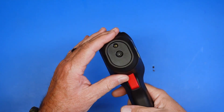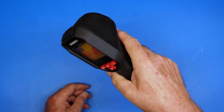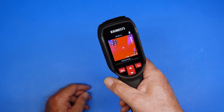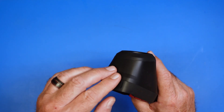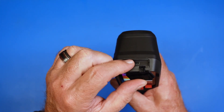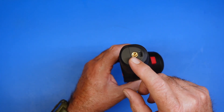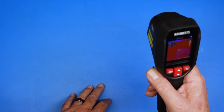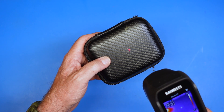The device is very well made. On the front there's the laser as well as the sensor. It's got an excellent grip and it doesn't weigh very much. This is drop safe to 1.5 meters and has some level of water protection as well — I would not call it submersion-proof since this little hatch is not exactly sealed; it would just keep random moisture out. It can be charged and you can read data off of it via the USB-C connector. Another interesting feature: it has a standard quarter-twenty tripod mount, so you can actually mount this on a tripod. A half press of the trigger button gives the aiming laser, and a full press grabs a photo of whatever you're aiming at.